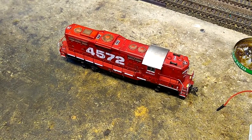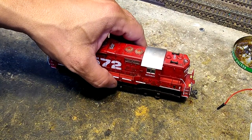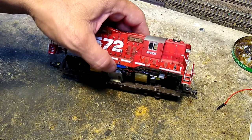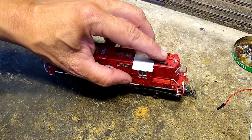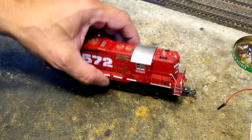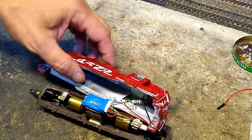That's not the way it is under this hood. I tried a bunch of different ways and actually smoked a resistor doing this because I was not reading the diagram right. The diagram is in the actual Digitrax decoder manual — it is not in the decoder instruction sheet that comes with it. Anyway, let's take a look at what we've got in here.